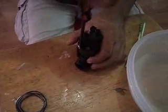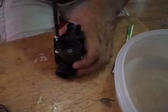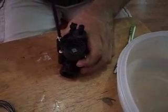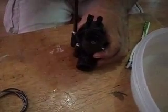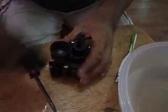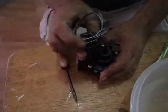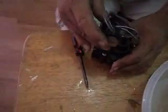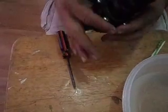You have to do this every time you see your valve is stuck in the open position, or if it's not opening. You might as well also grab a voltmeter, because most likely there's not enough voltage to the solenoid to open that valve. So there you go. This is how you clean and service your valve diaphragm.